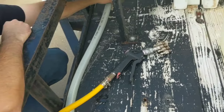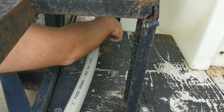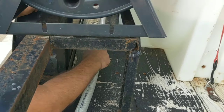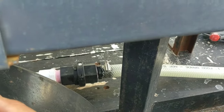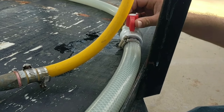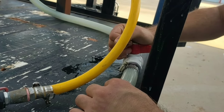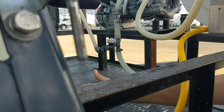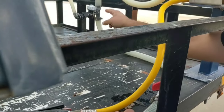What we have is a T plumbed in at the bottom of this water tank. We have a one-inch slip-on by one-inch male pipe threaded nipple that goes onto this, which adapts to this one-inch check valve. Then we put on a one-inch barb, worm clamp, one-inch hose, one-inch barb, worm clamp, and a one-inch PVC ball valve. This is what you can use to turn the water on or off. If you want to reduce how much water you're using, because you have a half-inch metering valve on your bleach, you can choke this and reduce how much water you have, and then increase the intensity of your bleach.